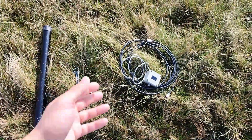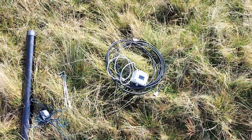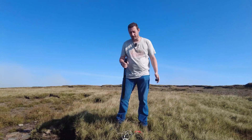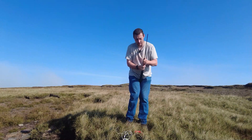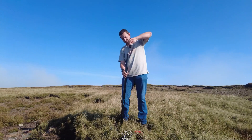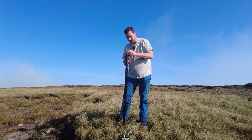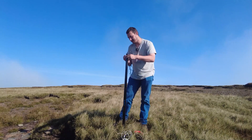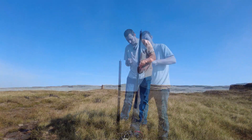That 49-to-1 is really overkill for what we're doing today - you can get much smaller ones - but it works at the end of the day. Let's get this antenna set up. Spider beam mast - take the cap off, put that somewhere safe. Top section out and bottom section out. When that's extended that gives me something to grab hold of. Guy ring - just going to slide over the top there, making sure the lines are fairly equally spaced.